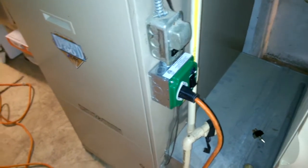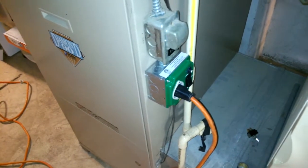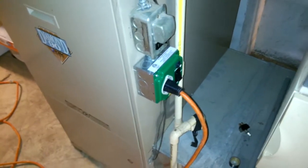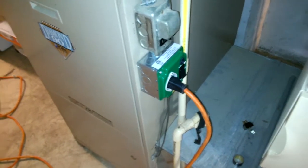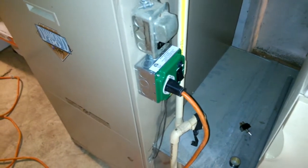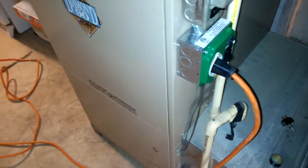That's about average temperatures for mid-December — 30 degrees in the day to 20 degrees at night. What I found is that when the blower and all the components are running on the furnace, it uses around 560 watts. At 560 watts, in my mind, I would probably get away with a 1,500-watt pure sine wave inverter.